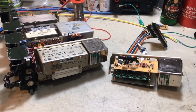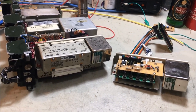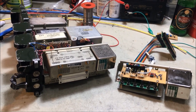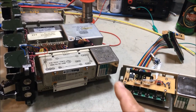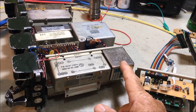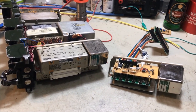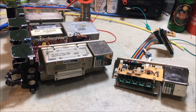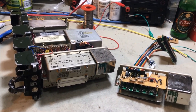Before we go any further, I'm just going to briefly describe the lower sideband conversion. In my prototype, the DDS had two outputs for the variable frequency and the fixed frequency, and I was able to adjust the fixed frequency oscillator to replace unit eight, which is the reference oscillator. And by changing the frequency of the DDS fixed frequency, I could go between upper and lower sideband, which was good. But the problem with the Arduino modules,